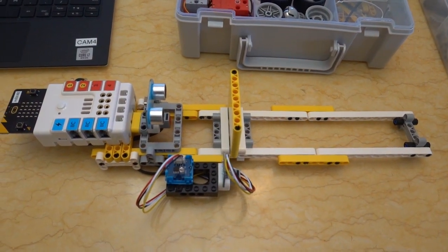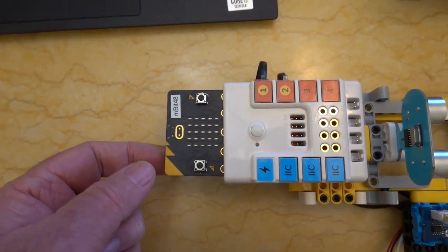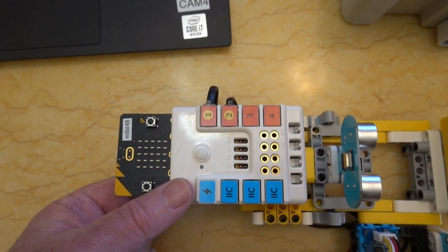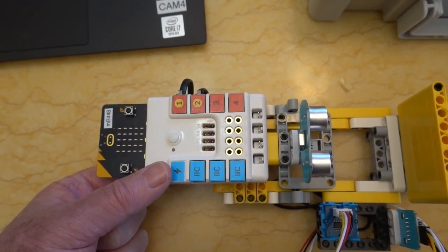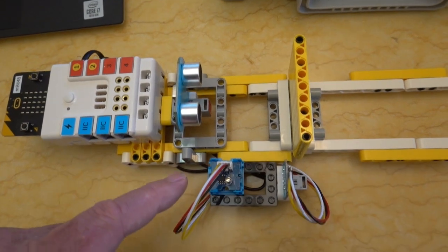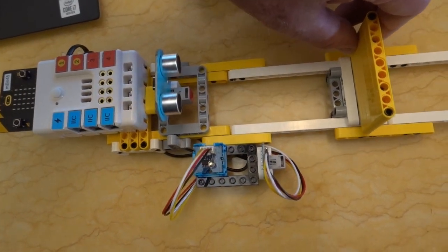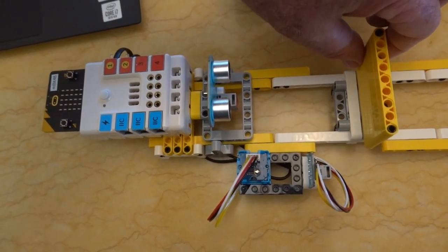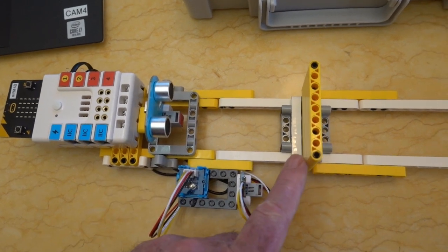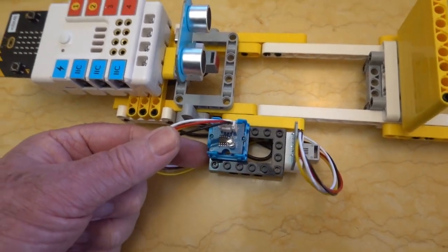So this is case study number 47, and what we have is at one end a microbit computer, and a microbit adapter that interfaces through RJ11 sockets to electronics. And this simple project has 2 sensors, an ultrasonic sensor and also a light sensor. And it works a little bit like a theremin. That is, it translates distance into musical notes. And 2 hands are needed to operate this. So one hand for the note and the other hand for the volume control. It's using a light sensor.